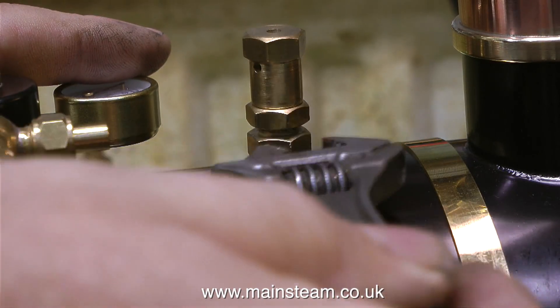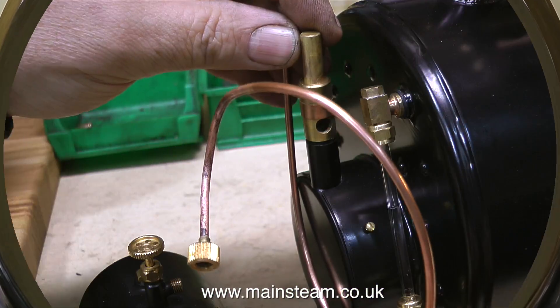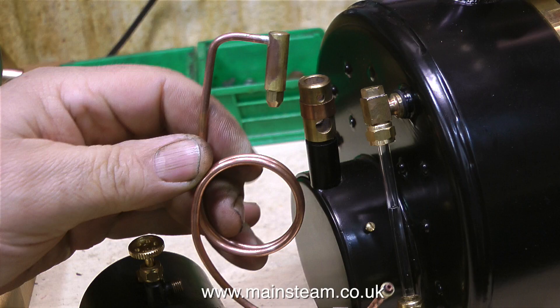It's time to replace the safety valve and light the gas burner — but first I need to pipe it to the tank. All you get with the kit is a fitting for the gas tank and a jet holder, connected by a piece of 1/8-inch diameter copper pipe. This pipe was really hard and almost impossible to bend; I had to anneal it by heating to dull red and quenching in water. Then I could bend it easily, and after cleaning up the pipe after annealing, everything is looking okay.